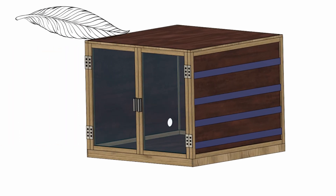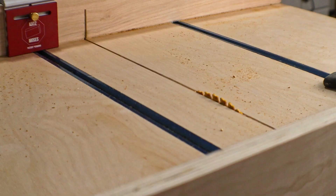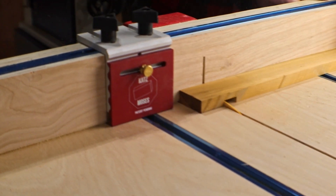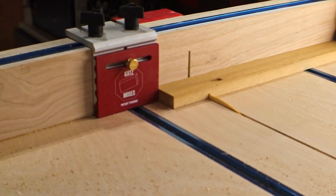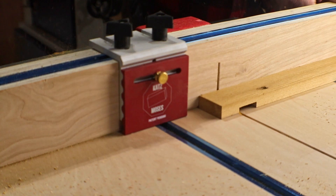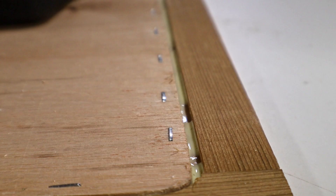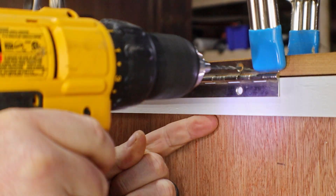It's finally time to make the lid. I wanted to make this as light as possible, so I'm going to use the same reclaimed wood. I built an outer frame using half-lap joints cut out on the table saw using the crosscut sled. This was a little tedious with a standard blade — it might have been better to use a dado stack, but this was much faster to set up. Then I routed out a channel for the top panel to sit in. These panels can be pretty warped, so I added some glue all the way around, and the only thing I had that was thin enough not to punch all the way through was some staples. I put in a whole bunch to help keep it all together. Once that was all dry, it's time to attach the lid.